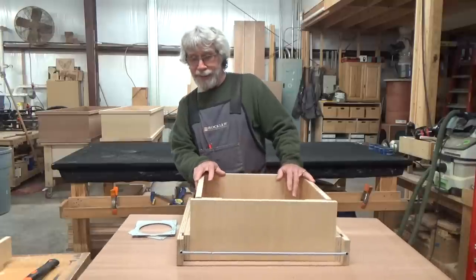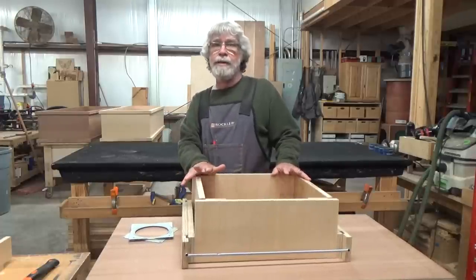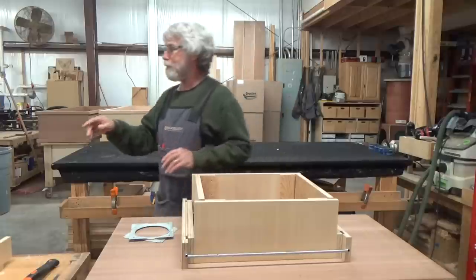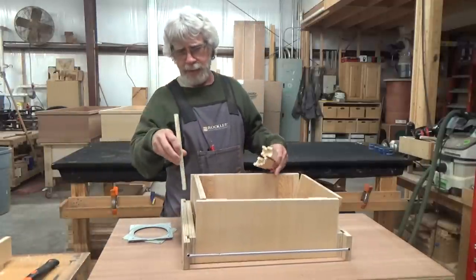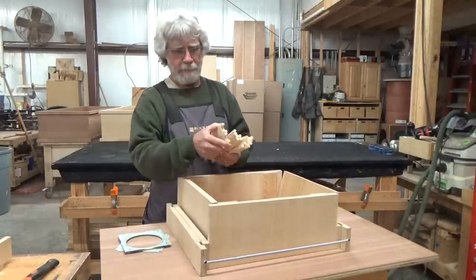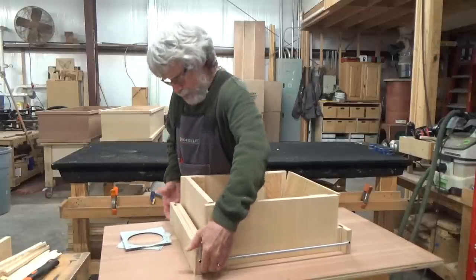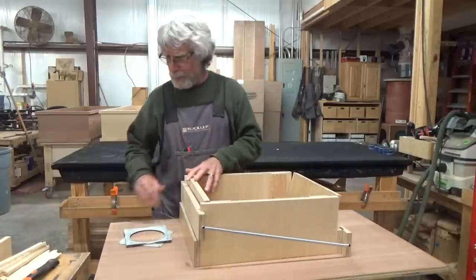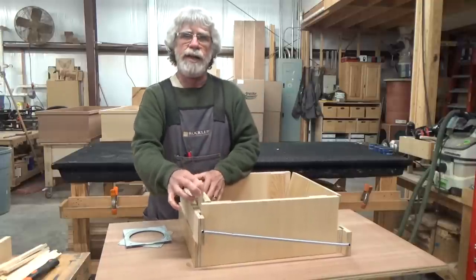But thanks, JC, for that link. It gives all the dimensions and everything on how to build this fixture. And it's a 10-frame fixture. What it simply does is, let me grab some parts. Our side frames slide into a slot on the side of it. And you load up your 10 side pieces on it. And then once you have 10 frames loaded up, you grab your tension bar, which is held together by door springs, one on each side, and you lock it in place. And by doing that, your side frames get locked in and held in place.